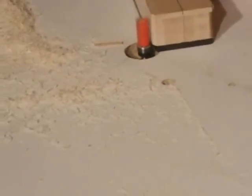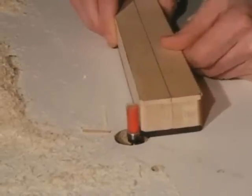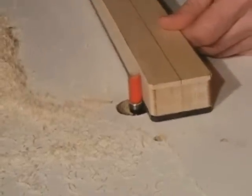Now we're on to the heel. Here I'm slowly working around the corner of the neck. When I prepared this blank, I brought it as close to that template as I felt I could without going past it, so that I had less material for that bit to grab. If you're going to have any trouble, that's where you're going to have it.